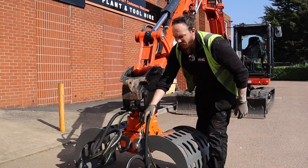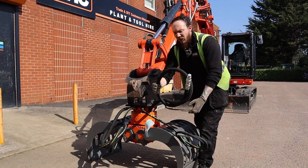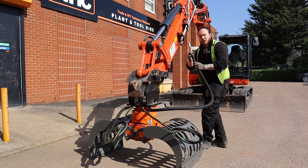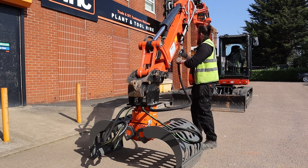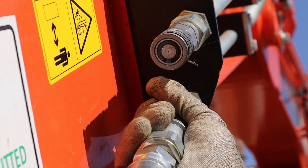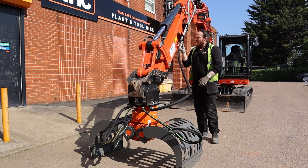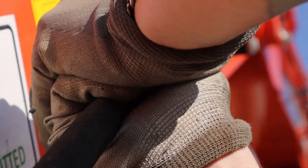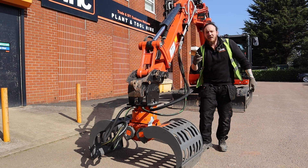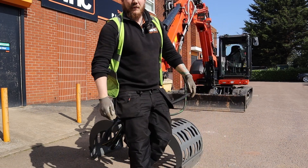Round to your attachment, unravel your hoses and couple up to the auxiliary outputs found on the arm of the excavator. It's always best to start with the big ones first, which are on the bottom — just pop them in and push upwards until they click into place, then twist the lock to ensure they're secure. Then repeat the process on the other side of the machine.